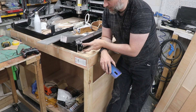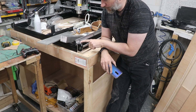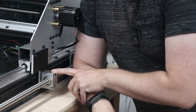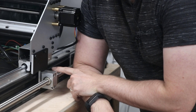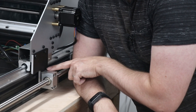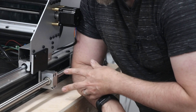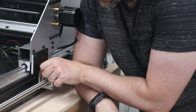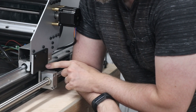This is a pretty simple piece. Because we're going into these slots, we can loosen these nuts and adjust it forwards and backwards if necessary, which was useful for alignment. Moving back to the middle of the machine - this was probably the trickiest component, just that it had the most operations. Obviously bore through the center to meet the ball screw nut here. On the other side there are a pattern of holes drilled on a circular basis - I think 19mm off center, 5mm tapped for mounting the nut. Crosswise we have some countersunk 6mm holes for mounting to this piece of plate. This was originally the gantry plate on the Ox - I just cut chunks out to provide this part.